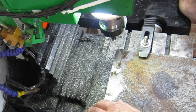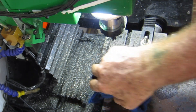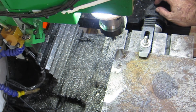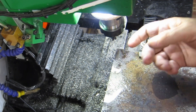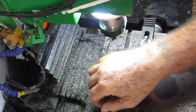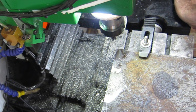I don't know exactly how long that's taken but it's in the three and a half to four hour range. I stopped about halfway through because this was so damn hot you couldn't touch it. Fortunately when they cut it, it was cut on a bit of an angle this way, so the deeper I got the less I was cutting. When I got about 6mm in I went up from a half-mill cut to a 1mm cut, and once past halfway I upped the feed rate which got me through it a whole lot quicker - otherwise I'd still be going.